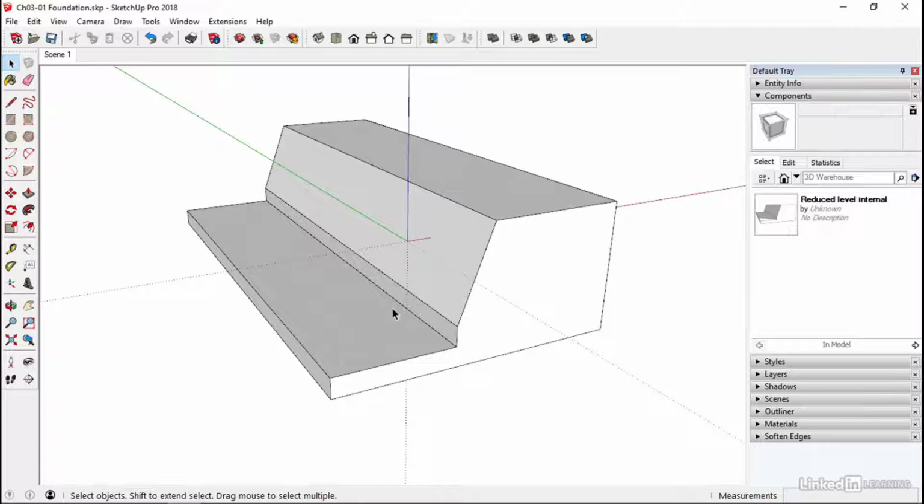Now, obviously, I'm making massive assumptions here that this is going to be suitable for our needs, but always consult the structural engineer or ground worker, or in the UK, maybe the building control officer can offer advice, but you'd need to get some sort of report done on the ground, especially if it's in an area where previous buildings have been. It may be a brownfield site, as they're referred to, might have had underground works. So very, very essential that you check out what you're building on before you build it. There might also be contamination that needs to be stripped away.